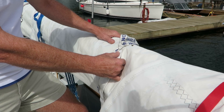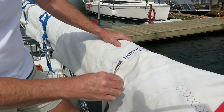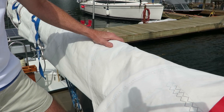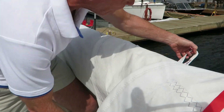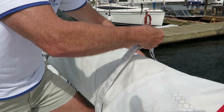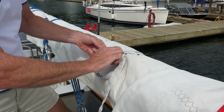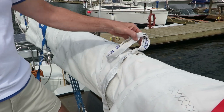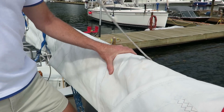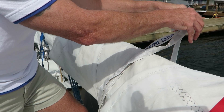Let's take a closer look at how to correctly tie a sail tie. Ideally, sail ties should be tied so you can remove them with one hand while holding on with the other. What I like to do is have the eye facing away from me, put the tail in through the eye, pull back, and then put a half hitch on the bight like this — and that's it. They don't have to be super tight, just enough to hold the sail and be able to undo it with one hand while holding on safely.